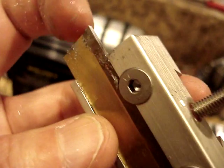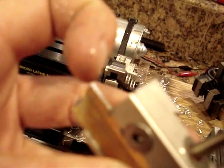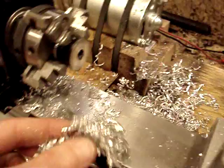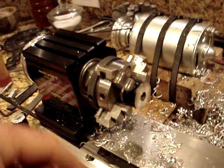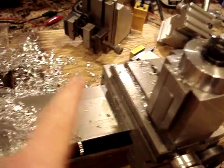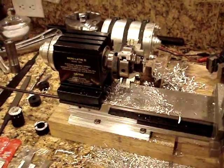So that was cutting — I can feel it's raised a little burr, so I should probably hone that down. Usually with aluminum, if you're not careful it'll come up a little bit. Anyway, hope you enjoyed the video. That's kind of what you want to look for. If you're not getting that, the problem is probably rigidity somewhere — in the chuck, the work, somewhere in there. The chatter will break the chip and also slow you way down. But if everything's cool, basically it should part off just the way you drill into aluminum. Hope you've enjoyed the video. Good luck.